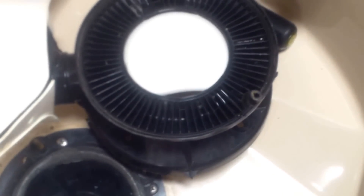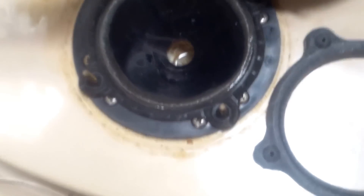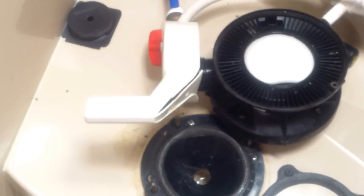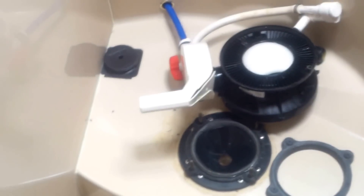The only thing above my tester — because my tester fit right in that hole — is the floor flange seal. There is also a bowl gasket which sits right on this lid right there. Normally when they go bad they'll suck the water out, and it wasn't sucking water out. So it's either the floor flange kit — it's not a perfect science — or there is a shaft that connects this pedal to this half ball cock. That shaft has two o-rings on it and it could be that shaft. I won't know until I get the flange seal on, so let me reassemble it — it shouldn't take long — and then we'll do a startup.